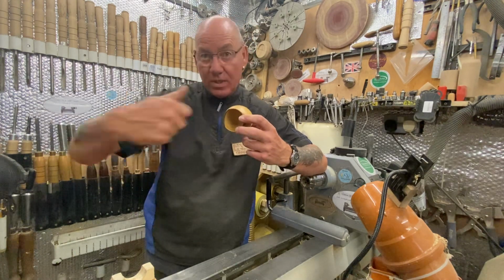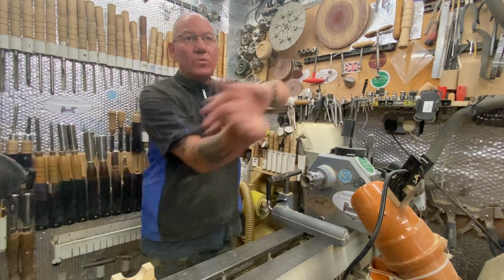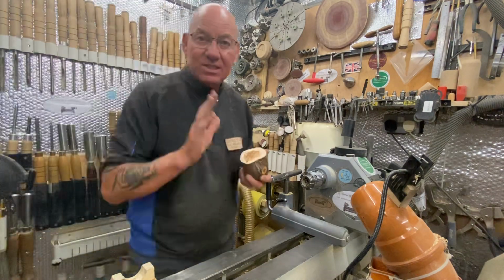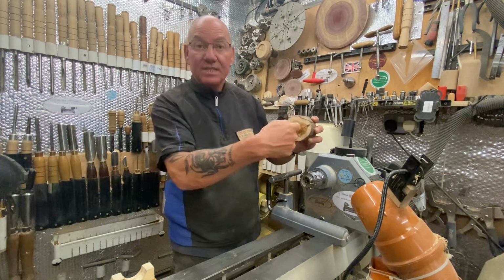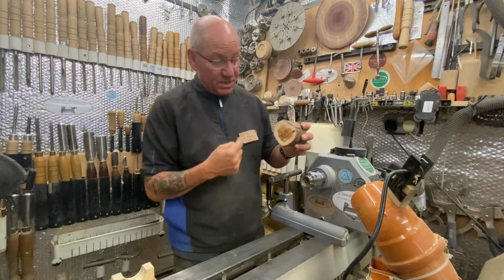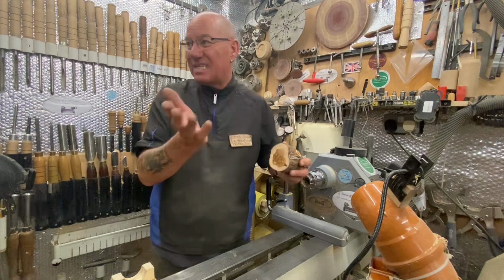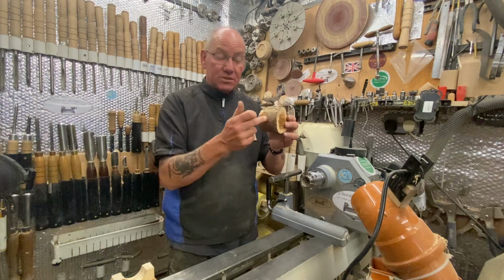Okay. End grain, pull cut. So that's simply for new turners, not you. You know it all, got your t-shirt, been there 40 years turning. Go away, nothing for you here. You already know this. New turners, this is for you. Right, turn it that way, end grain. Cut from the centre, out. Don't cut from this way, in. One, you'll get skids, skip backs. Two, all you're going to do is push all the fibres out, get a rough finish. Very hard. You can't even sand them out really because you pull them out and they're all raised out. Okay, that way, side grain.